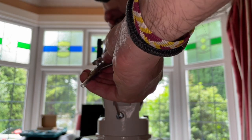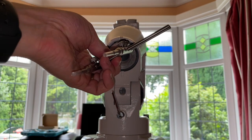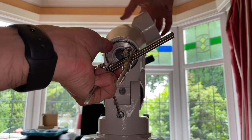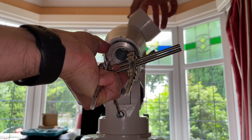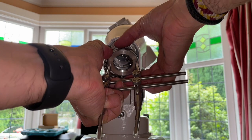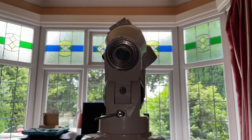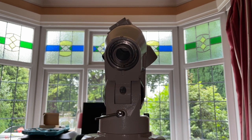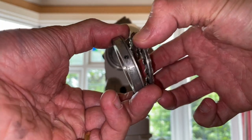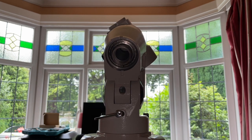And then finally we're at the stage of removing the ring that's keeping the whole right ascension mechanism in place. Basically, keeping that tool in place to keep the ring in place and then just rotating the whole right ascension mechanism so you're unscrewing it that way — it's much quicker doing that than trying to do it the other way around and moving the tool to keep it in place. As you've seen, there's a bearing behind that ring — it's an enclosed bearing so you're not going to need to worry about ball bearings flying all over the place. There are a couple of races and then the bearing itself — just make sure that you remember the ordering of those. If any of this is damaged, there are a number of places that you can reorder these bearings from, but fortunately for my mount I didn't need to do that.